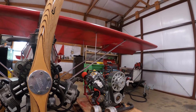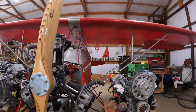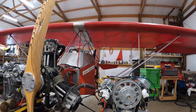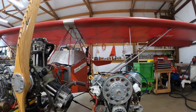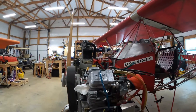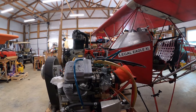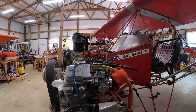It's a fun engine to fly. My fuel tank is down low in my fuselage, so I have to have a fuel pump. If your tank is up in the wing where they belong — and that's where Leonard's got it shown and designed — you don't need a fuel pump. It's got dual Mikuni carburetors that take care of the fuel real well. I've got the heavy cast iron flywheel on it right now so I have an electrical system, and it smooths the engine out just a little bit. It is a good engine.